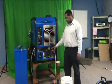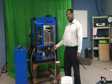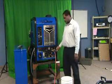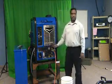Make sure your pressure is below 1200 psi when going through the low pressure fittings. For your high pressure tool, you'll want to put the pressure up a little bit, and that allows you to go through the upper circuit. Flip your pressure selector to make sure it goes through both circuits.